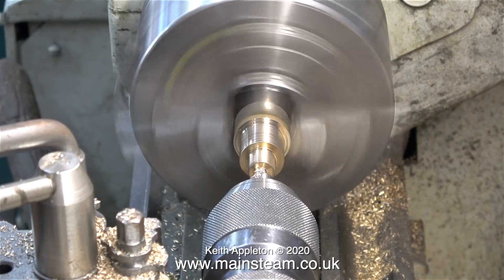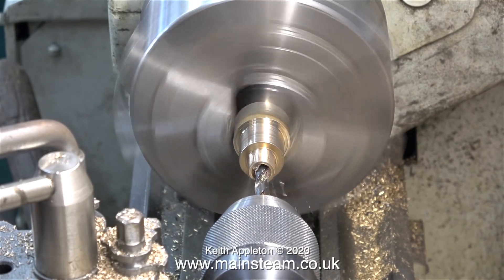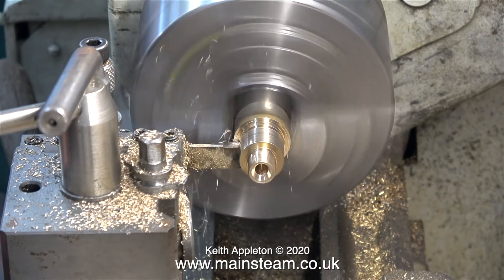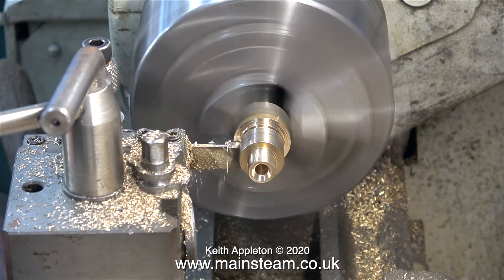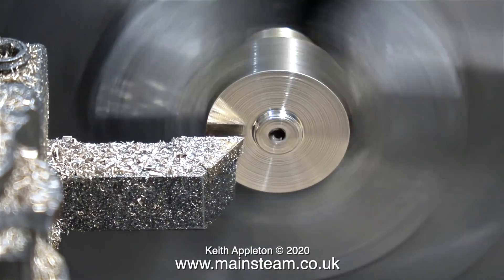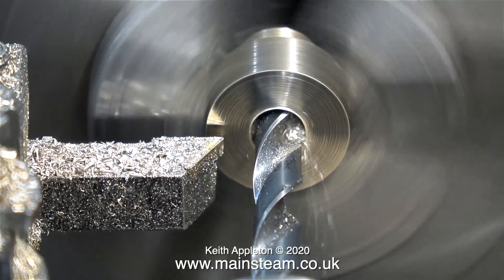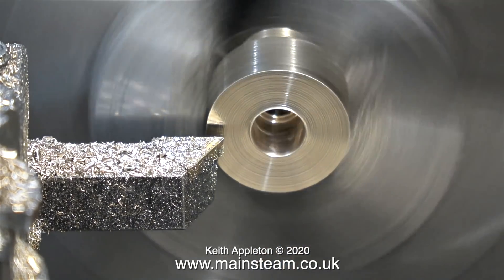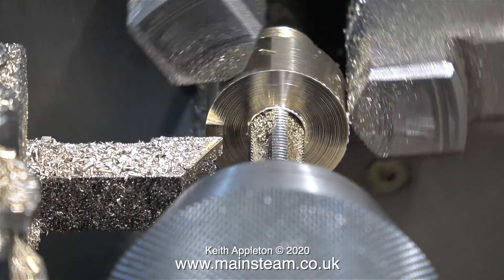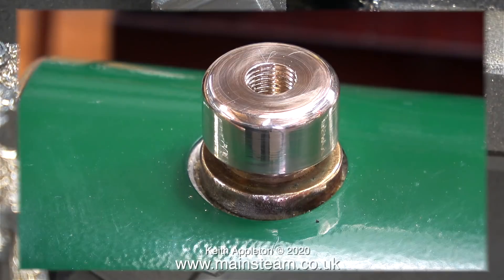Now I need to drill a hole all the way through this piece of work. The first thing to do is to drill a center hole, followed by a twist drill which is 7/32nds of an inch in diameter. Once drilled all the way through, I parted it off. Then I mounted the part in the three-jaw chuck with the threaded part innermost. This drill is 9/32nds of an inch in diameter — it's tapping size for 5/16ths by 32 threads per inch. In this clip I'm manually threading it by turning the chuck by hand, using a 5/16ths by 32 threads per inch tap.